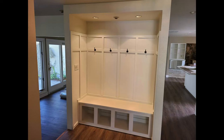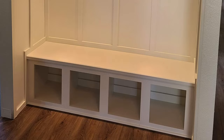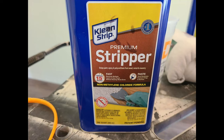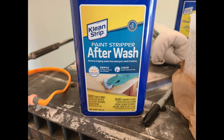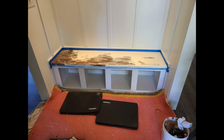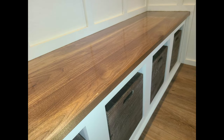But that's when everything went horribly wrong — the painters primed and painted over the walnut top. I couldn't believe it when my client called to tell me. I went back the next day, but the damage was done. I had to use a stripper to remove all of the finish, then use a good after-wash and some spirits to raise my spirits. Then I sanded it down to bare wood and applied three coats of polyurethane again just like before. At last it was finished, it looked good, and my client was very happy with the end result.